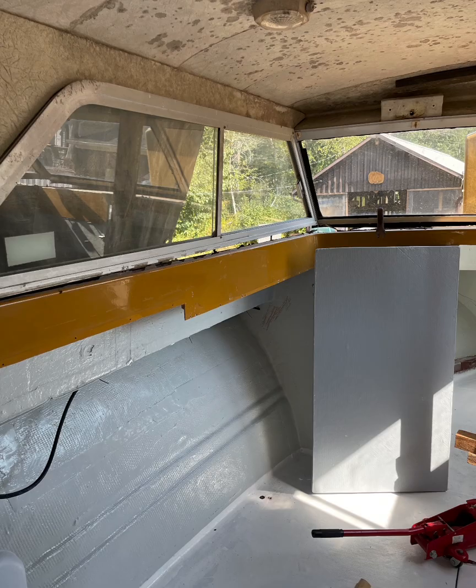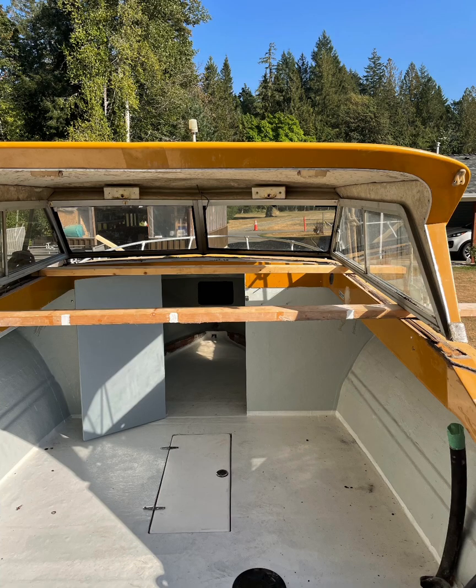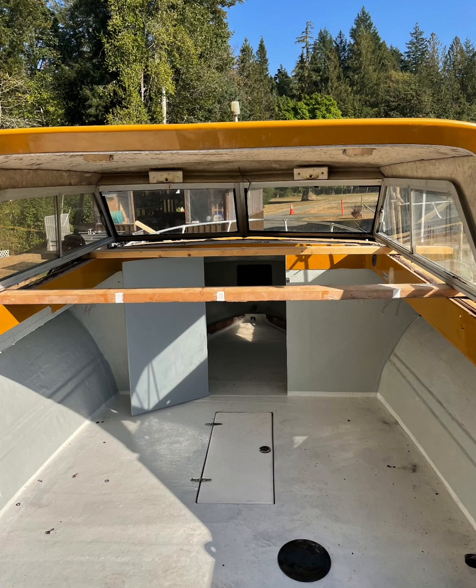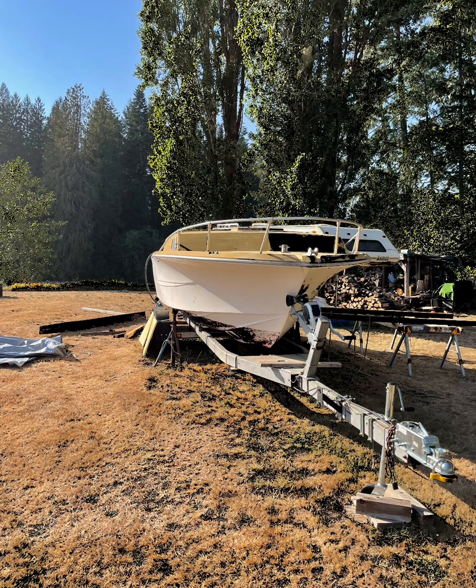So then I jacked it up and just popped it loose from the silicone and such that was holding it down. And then I slid some 2x4s underneath the roof. So you can see here, 2x4s underneath. And then we fastened it with some rope to those 2x4s. We put two 4x4s on the side of the boat, spaced the same as the 2x4s, and they were on about a 45-degree angle down to some sawhorses. And I lifted the roof and slid it down and then ended up putting it onto the sawhorses. So it was actually pretty simple to do.